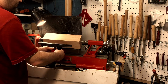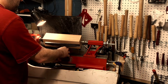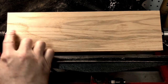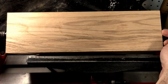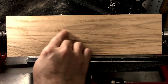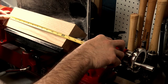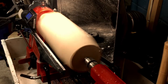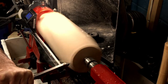Now using carbide tools, which are a lot thicker than my normal traditional tools, I'm going to lower the tool rest so the tool sits right at center line for maximum material removal. There's a small crack that runs from one end all the way to the other and I'm not sure how deep the crack goes, but I'm hoping it'll turn away. This piece of ash wood is approximately 13 inches long and 4 by 4 inches. I've really developed a liking to carbide tools recently — they really cut down on time having to sharpen your tools throughout a project.